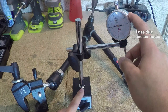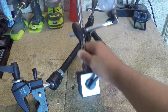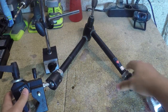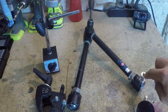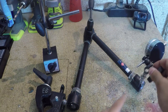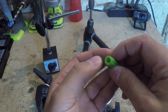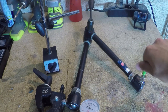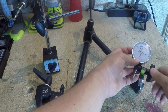To align my linear rails, I bought this dial indicator with a mag base. But literally the second I held it in my hands, I realized that aluminium is not magnetic, so it's pretty useless to me right now. The second option was this camera mount with three degrees of freedom and a quarter-inch, 20 threads per inch thread. With the power of 3D printing, I managed to print an adapter — one side has the threads and the other side is 10 millimeters, which fits perfectly. I can thread that on very easily and then mount my dial indicator. And that actually worked surprisingly well.